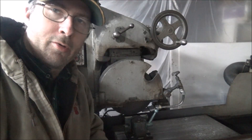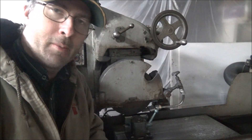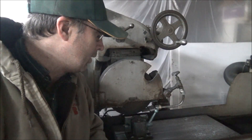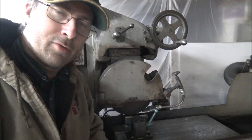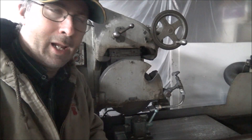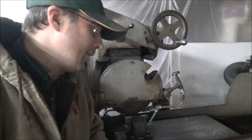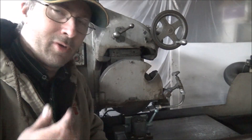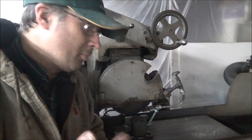I hope you enjoyed this little grinder upgrade and getting to see these tappets get ground. I've got to finish this job up and then get Bailey's approval on it, and then these will be ready to go to the customer. So far I'm liking this — it seems to do a lot better job than the single nozzle deal I had, and I think it's improved the surface finish some too. I can't tell for sure, but just looking at it they may look a little bit better now, probably because it's flushing more of the grinding debris away, so there's less of it carried back around recutting, and you get fewer scratches in your surface with the better flush.